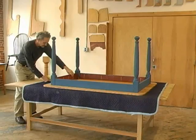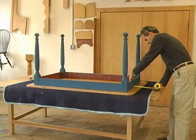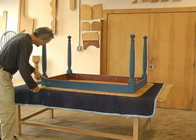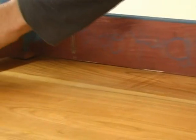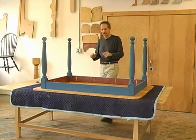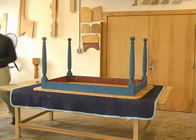So I have it on the table, top side down, bottom up, and we go around and measure — should be about a four-inch overhang, which is what I planned on this table. Before I actually go to put the screws in, I'm going to take a pencil and make what are called some witness marks, so if I happen to bump it or the screws pull it, I'll have a mark that I can just move the table base back to.